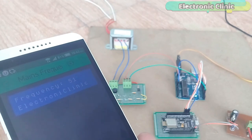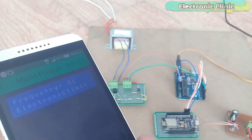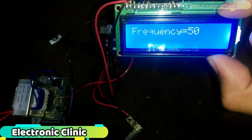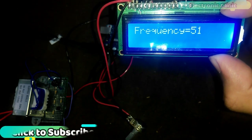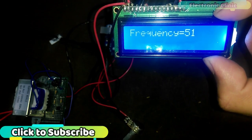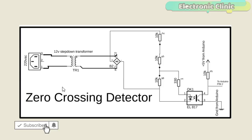This is the third version of the frequency monitoring system. In version 1, I used a 2N2222 NPN transistor to send on/off pulses to the Arduino and displayed the mains frequency on a 16x2 LCD. In version 2, I replaced the 2N2222 NPN transistor with the EL817 optocoupler to isolate the controller side from the AC voltage side, so anything happening on the AC side will have no effect on the controller side.